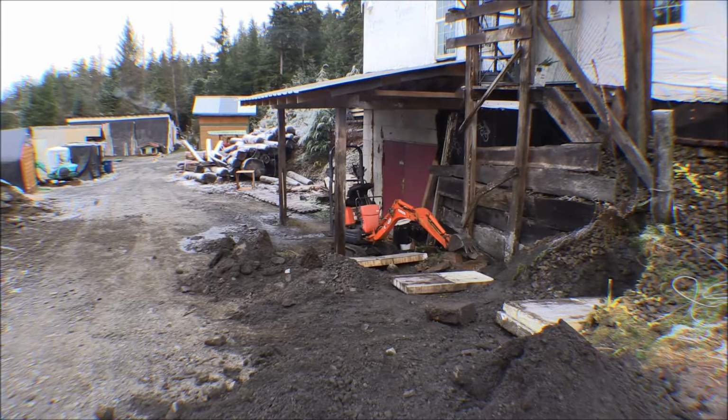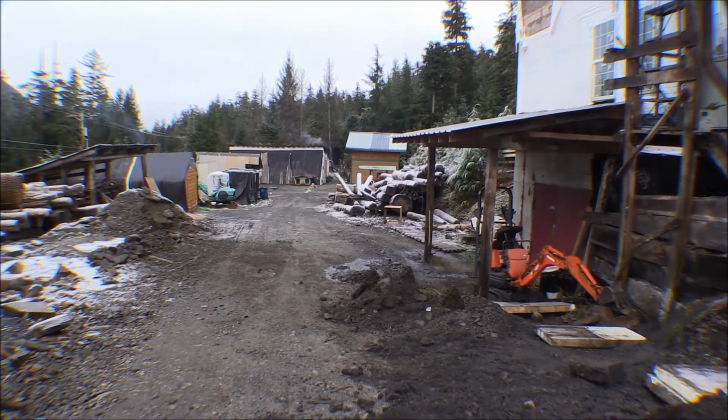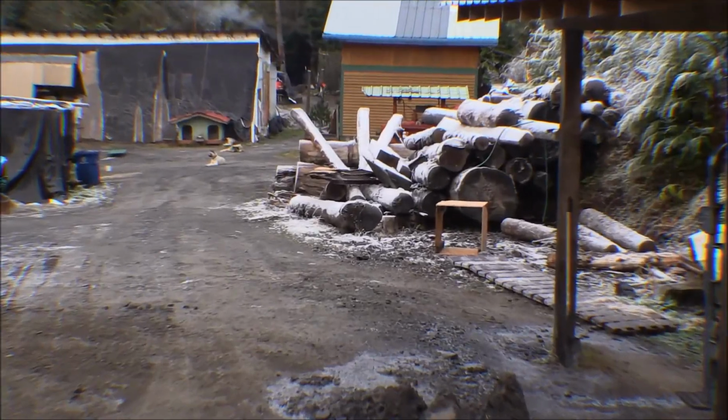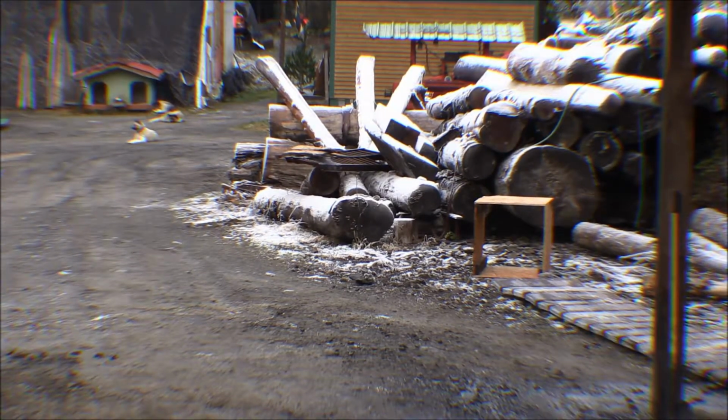Well, I've got my box made. There's one of the footings down there. That's the 3rd footing, or form for the footing. It's 2 foot cubed, which is kind of big, but I'll put some sand in the bottom of it, and I don't necessarily have to fill it all the way up, but I wanted to make sure I had a good firm footing for these posts when they go in, because they stick up quite a ways.